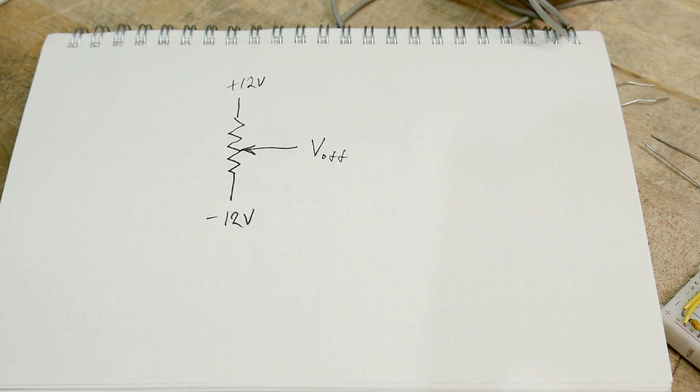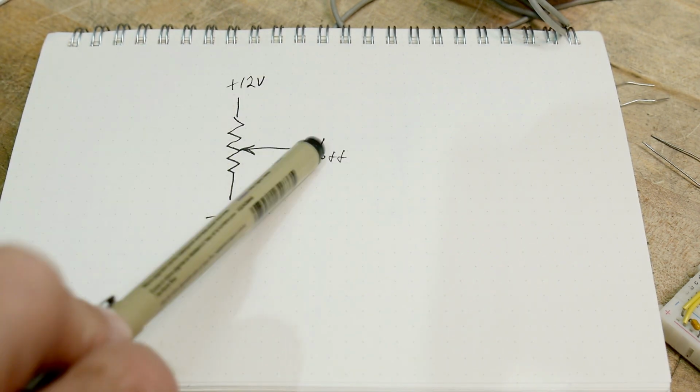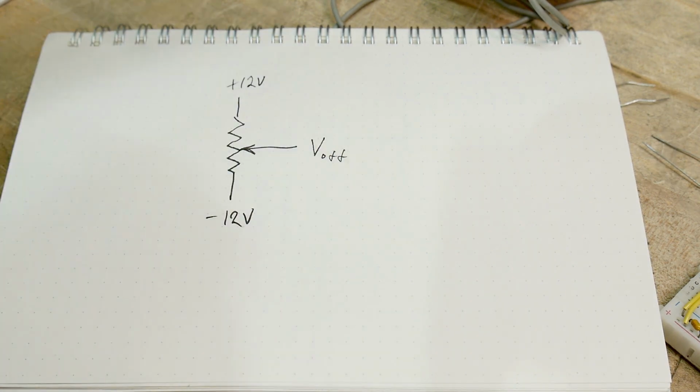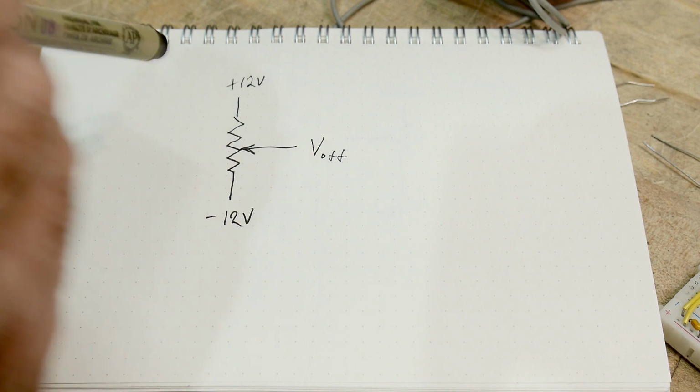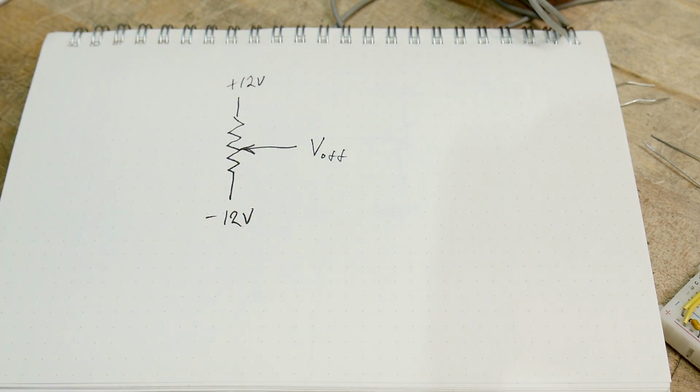Sorry, that particular design, it's just a hard adjustment. And how does that happen? I'll give you some insight into how that happens. So, here I'm designing a circuit and I need some voltage offset. I have some offset in my circuit that needs to be zeroed out, and it's something I can't just do. It has to be an adjustment at manufacturing time or at calibration time, and so I'm going to have to put some type of variable device in there.